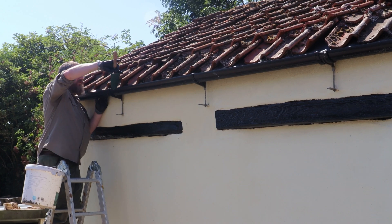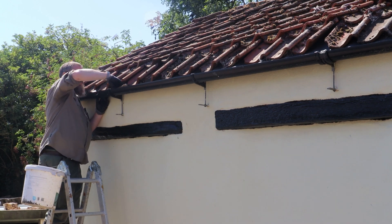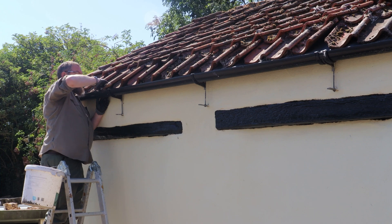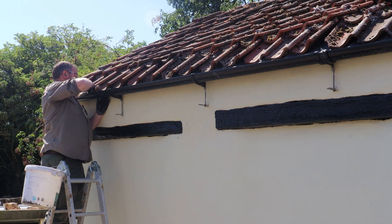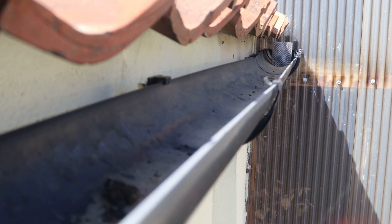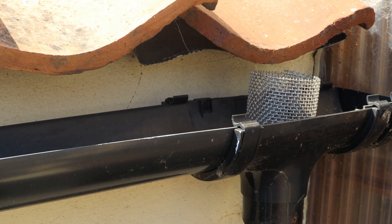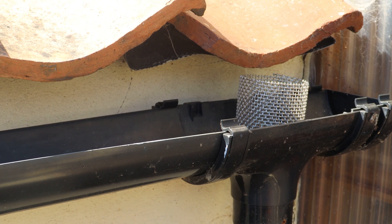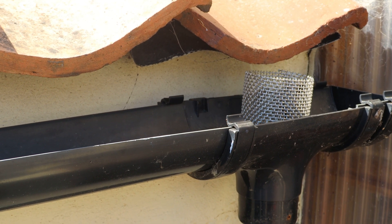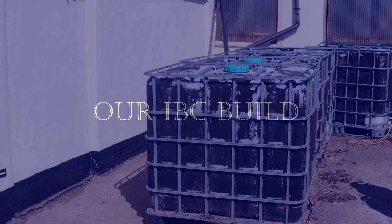You can see the dead moss in the top right corner of the screen. In cool wet times these terracotta tiles absorb moisture and make a great environment for moss to grow; in a dry spell the moisture evaporates, the moss dies, and it rolls or washes into the gutters and can block them completely. So we clean the gutters regularly and fit fine stainless mesh — I cut a piece, roll it up tight, push it into the downspout and let it uncoil so it sticks there, stopping debris from going down while still leaving space to clear the gutters.